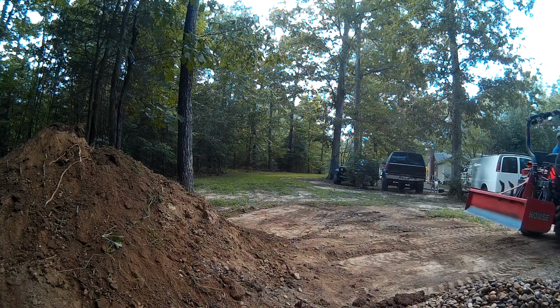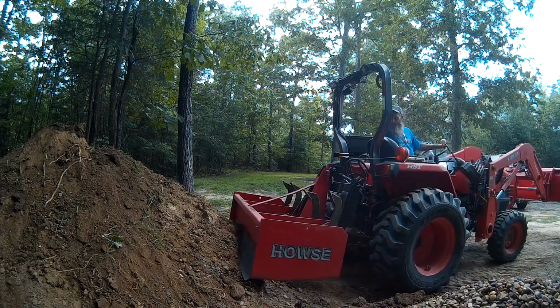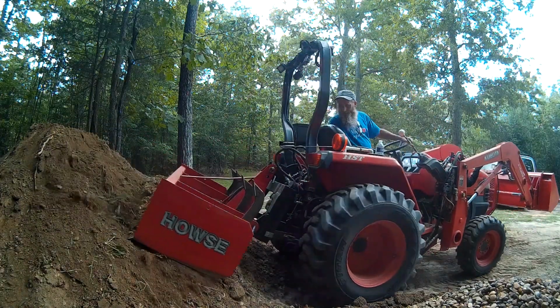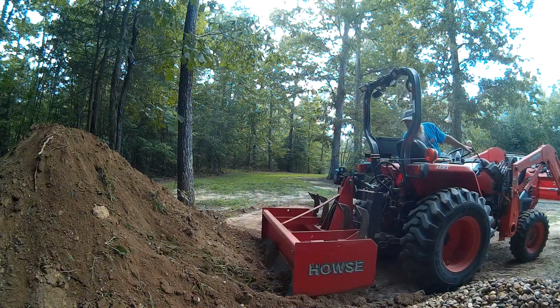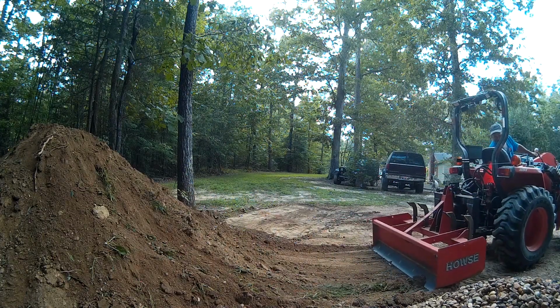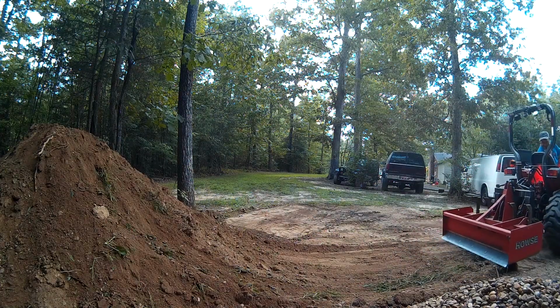Now where we've got that low spot right there, we went down a little too deep, we're going to go ahead on up this hill, grab us some dirt and fill that in. And we're working with the 3-point lift, bumping it up just a little bit so we can feather this on out.